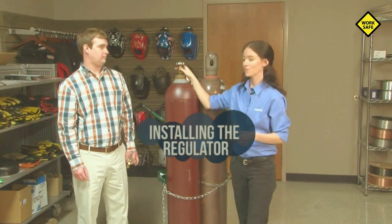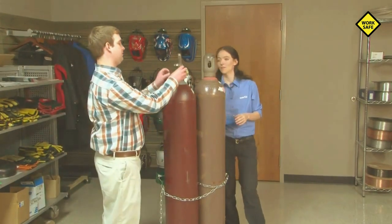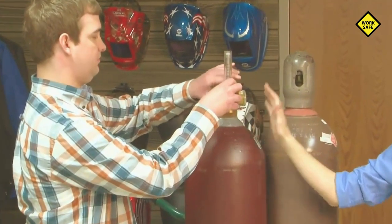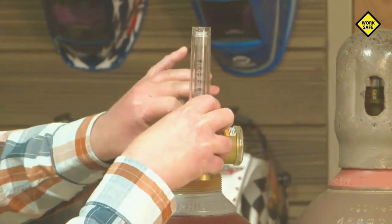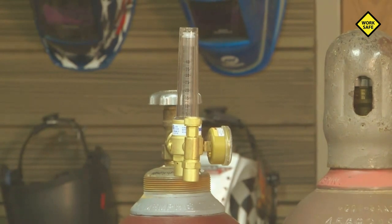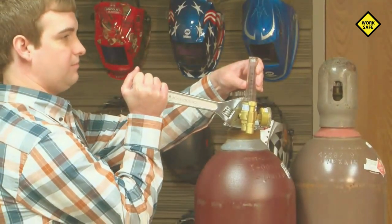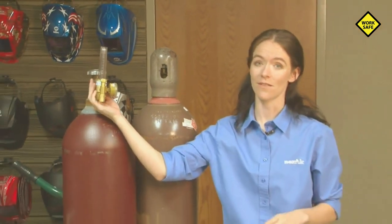When hooking up a cylinder, after you've ensured that there's nothing in there, start by hooking up your regulator. Start by hand tightening the regulator as far as possible. Always stand on the back side of any valves or openings to ensure that if the gas does come out and there's a failure in the regulator, there's no damage to a person — especially with oxygen. If you have an oxygen regulator, do not use it for any other gases, especially air. A small amount of oil or grease inside an oxygen regulator can cause failure in the whole system. After the regulator is hand tight, it needs to be tightened with a wrench — enough to ensure there are no leaks, but do not over-tighten. These are brass fittings and are very easily damaged. Any cross threading could ruin the whole thing and you'll have to replace the fittings themselves.